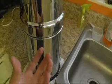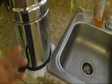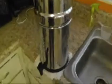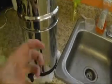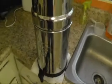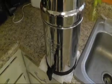The only thing I would mention is that the fluoride filters on the bottom here, you screw them up onto a threaded fitting that sticks down through, and you're only supposed to fit 8 rotations because the fitting may puncture through a membrane that's in the filter. And even after the 8 rotations, they feel kind of loose. So I didn't know if that was good or not. I would have liked to see a spacer that you could put up against the fitting, so you can tighten it down without it going more than 8 rotations, or space them appropriately. They're making the thing, they can make it so that it is already spaced right instead of having me worry about it. But that's a minor thing. It seems to be working fine as it is.